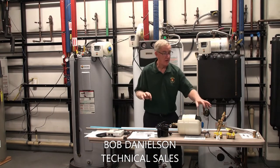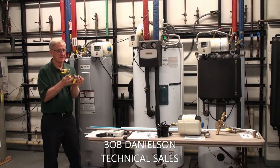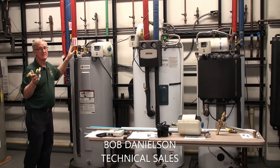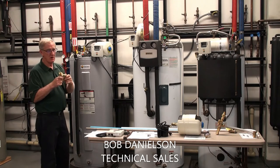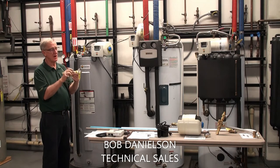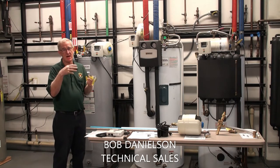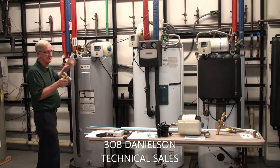The last water components of the system are these two ball valves and drain valves that you can see here and here. They're for isolating the system, servicing, shutting, and flushing maintenance. They all have arrow directions on the handles that allow you to set them properly, and to purge the air out — like when you hook up a water heater and open your faucets and air spits out. One of their purposes is to eliminate the air.